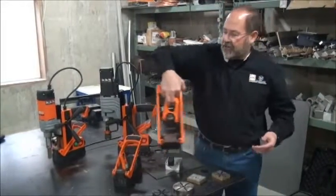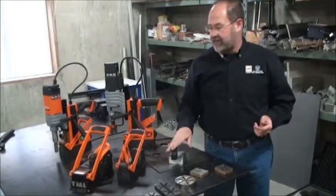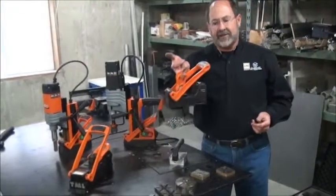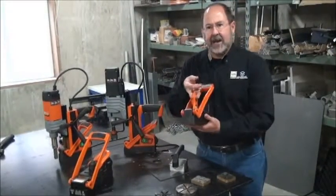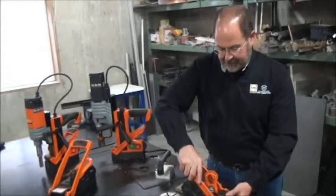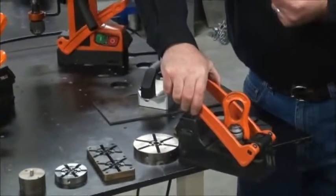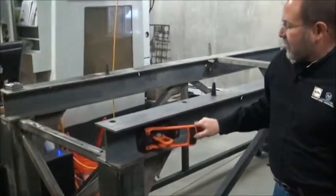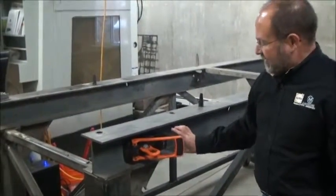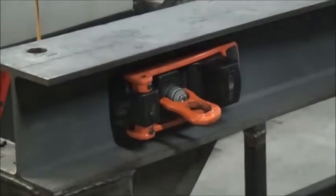When I say take these off the hook and use them, it's so important. When you have a magnet that weighs 15 pounds, 8 pounds, or 4 pounds, don't put it at the end of a hook and leave it there. I know they look great that way, but that's wasting an awful lot of the money you spent for them. Take it off the hook, bring it over to two pieces of plate steel, turn it on, and watch those high-low mismatches disappear in an instant. They're so compact and so easy to turn on. You can start to do things you could never do before, like use lifting magnets for lifting or fabrication, even on the thin and compact areas of webbing. Turn it on with one finger — no problem at all.